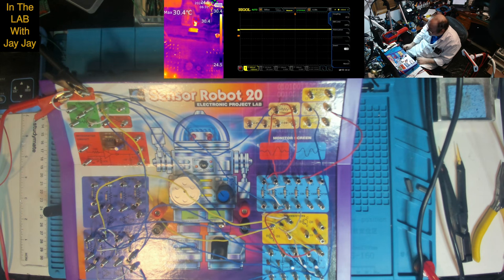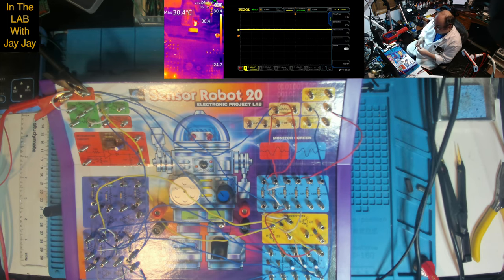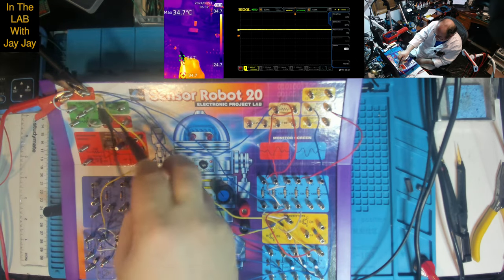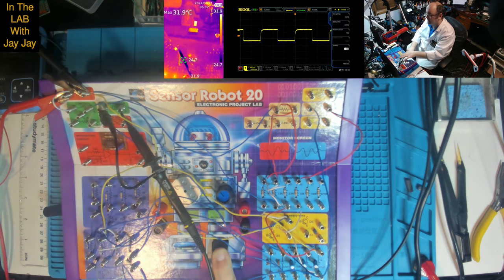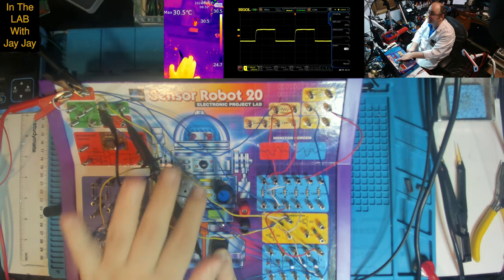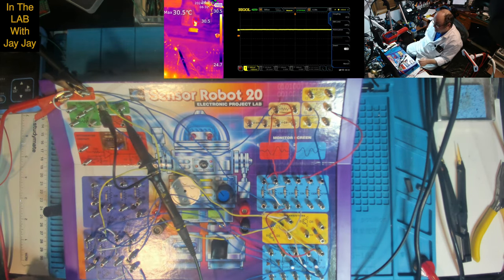There is a multivibrator in this circuit, so we should be able to get the wave, and we'll put this across the buzzer. So let's try him there and there and press that on there. There you go. And if we change the tone, there we go. So you see the CDS cell affects the pitch, which is equivalent to the wavelength.